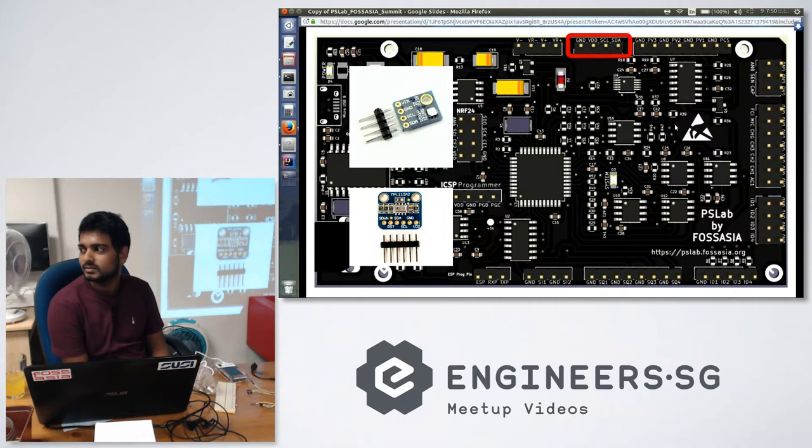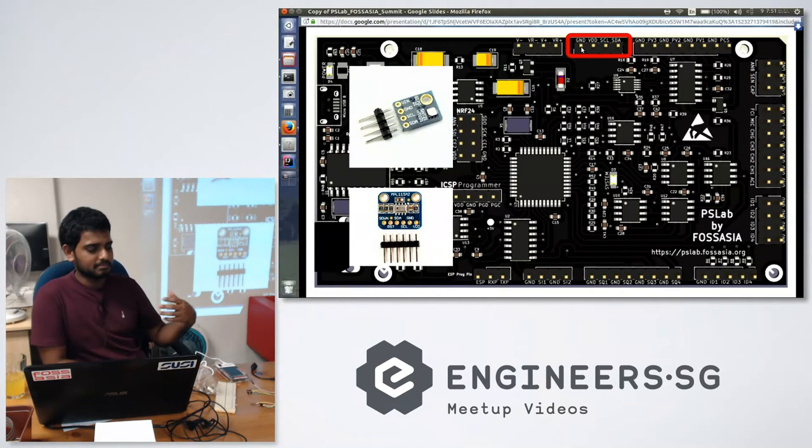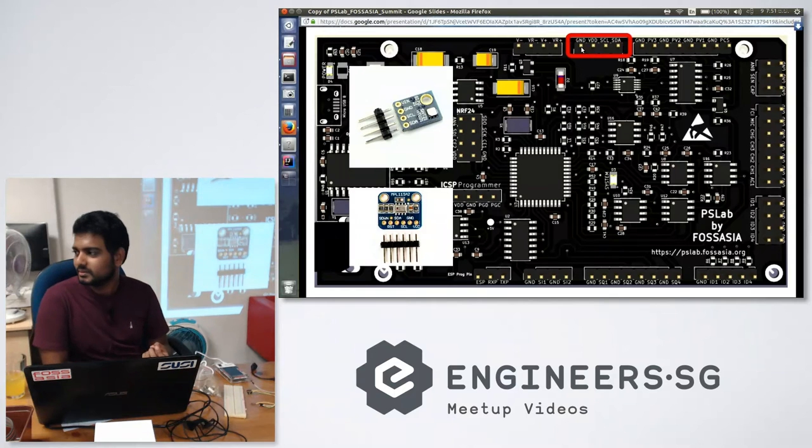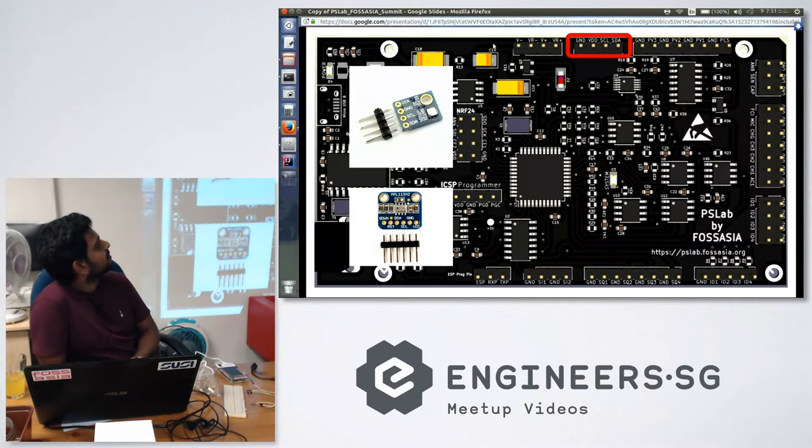Yes. You could use a bus with just two or three wires. You don't need additional pins. You can just daisy chain the sensors with I2C. That's one option. You mean with these four pins? Yes, you could do I2C on this. But the thing is, breadboards can be shaky, so we can have some additional connection on the board itself, because we have some space here, so we can spare that for a socket like this one.